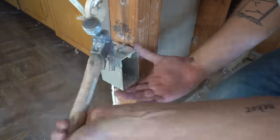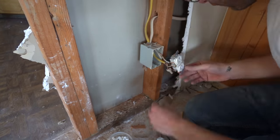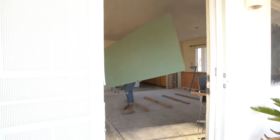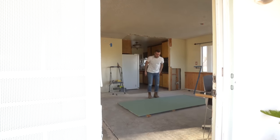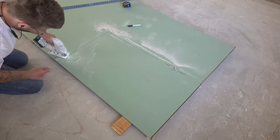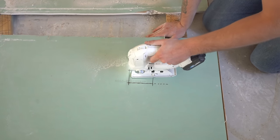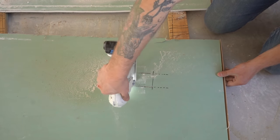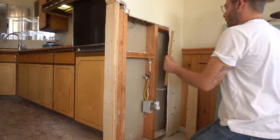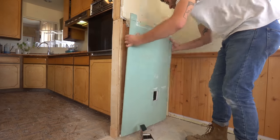I wired everything here the exact same, and I made sure to take a picture before I disassembled it, that way I could reference it and make sure I did everything correct. My house has half-inch drywall on both the walls and the ceiling, so I picked up a sheet for all of my repairs. I used a jigsaw with a fine tooth blade, and that worked great for all of my cuts. This piece is going to need a hole for the outlet box, so I did a plunge cut with my jigsaw after I measured and marked everything to get a good square cut. Before I attached that panel, I added plywood backing everywhere my old and new drywall is going to meet, that way it's reinforced and everything is really secure.